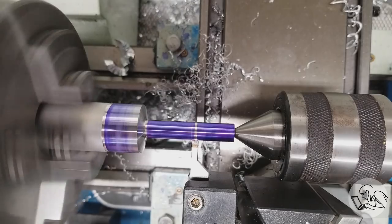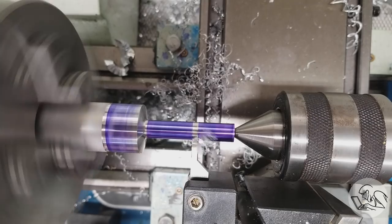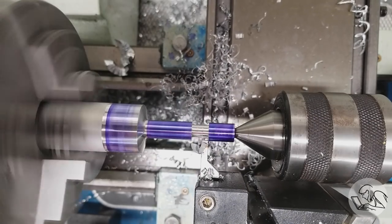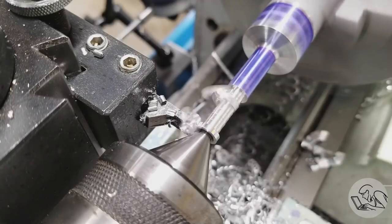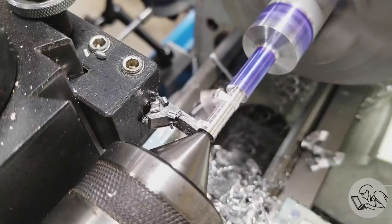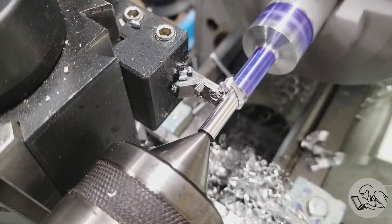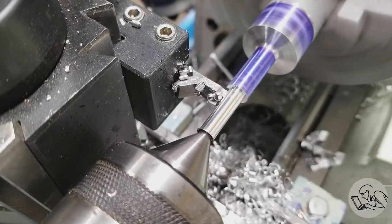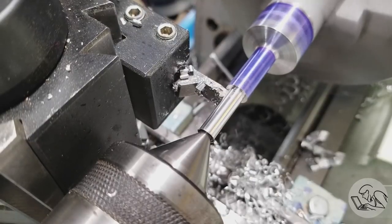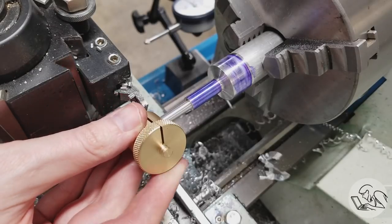And I can blue this up and mark the area where the shoulder is going to be. Now this shoulder has to be square because it's for clamping, and I'm going to use a grooving tool to turn down this whole area because I can't remove the tailstock, and it would be in the way if I was trying to use a shoulder turning technique. So this grooving tool makes quick work of that, and this is the same technique I showed when I made the arbor behind the brass part. And a quick test fit on the clearance section of the band clamp, and that slides on there very nicely,